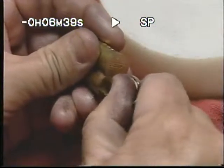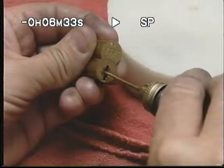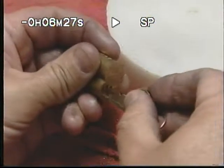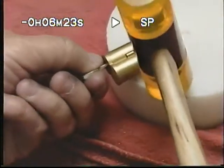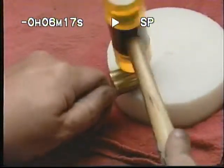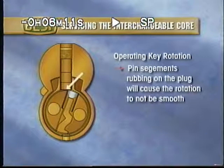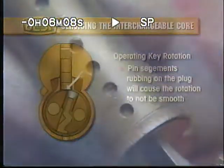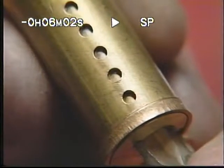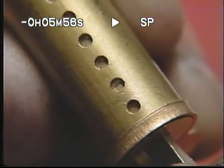If the operating key rotation is not smooth, there may be burrs in the core. First, try applying graphite. Then insert and turn the operating key a few times. If necessary, place the core on a Teflon block and lightly tap on the solid portion of the figure 8 with a plastic head hammer, and then try rotating the key. If the key rotation is still not smooth, the segments may be rubbing on the rotating surfaces. To determine this, rotate the key 180 degrees and look through the ejector holes for any shiny areas. If there are any, recombinate the barrel. And if the condition is still present, replace the core.